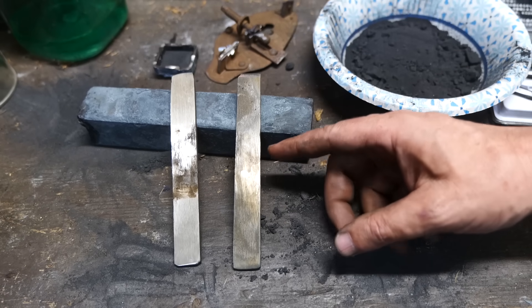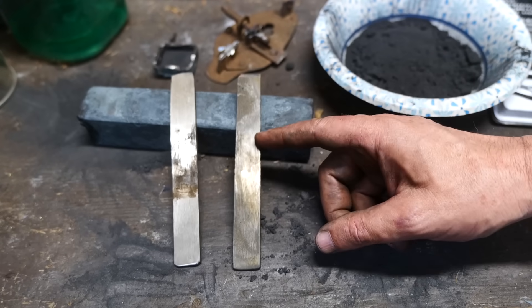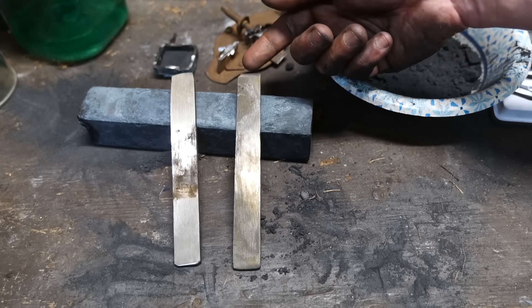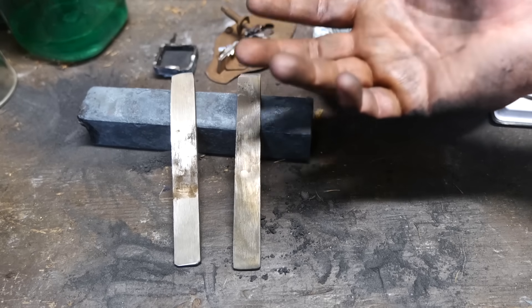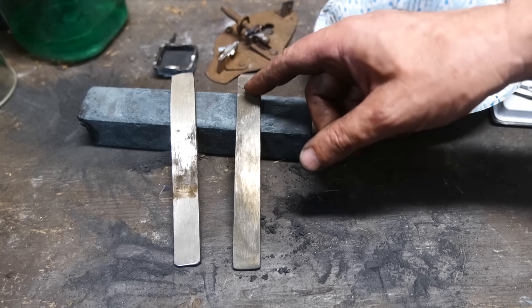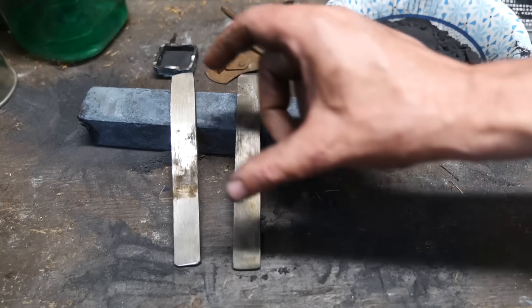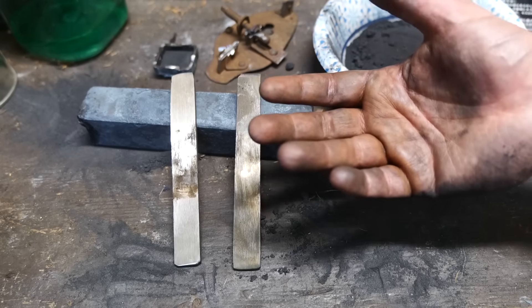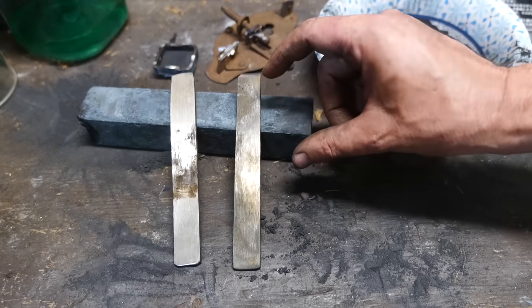There's too much carbon in here — this is either cast iron or something close to it, and it's going to be too brittle to make a knife out of. That middle black portion we saw end-on is perfect — I think that's still pretty high carbon and it'd probably make a good knife. The problem is there's not much of it. If we ground all this away and were left with those thin little strips in the middle, we could stack them and forge weld them together, but it still wouldn't be enough material to make anything more than a tiny two-inch blade.